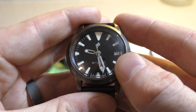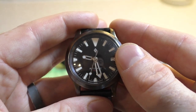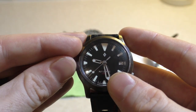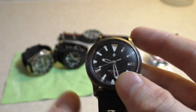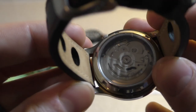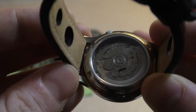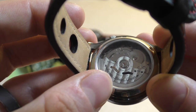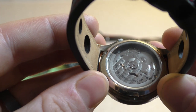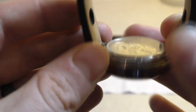The SNK shares basically all the DNA of any other Seiko. The dial is the same size — 28.5mm — and the hands are the same size, so any mod you can do dial- and hand-wise on the SKX you can do on this watch. You also get a lovely viewing caseback window as standard, which is great when you're getting into watch modding and you like seeing the movement. This one has been upgraded with a sapphire crystal, hence the slight blue tinge, and it doesn't have any Seiko branding on it — so you're essentially getting an upgrade to start with.